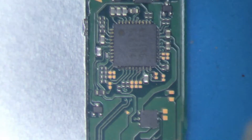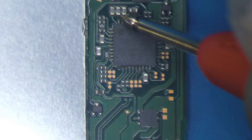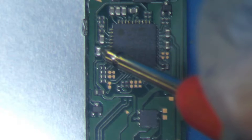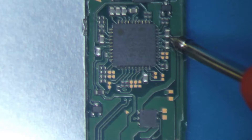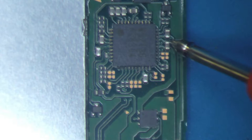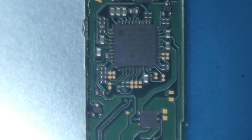Now I want to check out the M92 chip and see if this chip could possibly be shorted out. We have no short coming from any of these. A short from here will usually indicate something going on with the P13 chip, which is on the other side of the board. There is absolutely no short coming from this chip right here. No short, and no short.